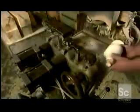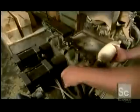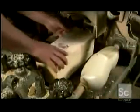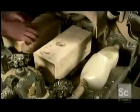The factory uses vinyl patterns like this one to create the shape of the shoe. There's a pattern for each size of every clog style. A worker locks the pattern into a duplication machine called the shaper. Then right next to it, 2 blanks. As this tracer moves over the shape of the pattern, the wheel on the left copies its movements exactly. Its blade shaving the wood as it moves up and down.